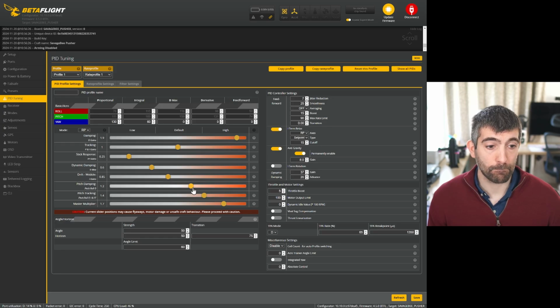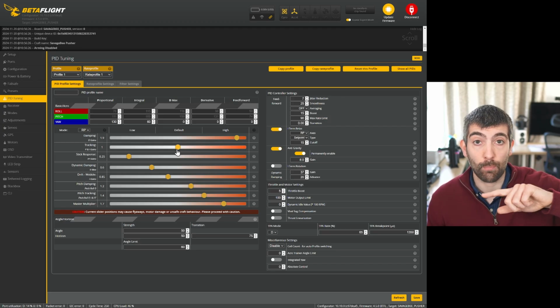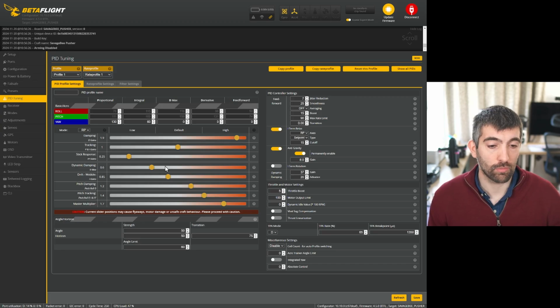And also the PD balance is going to be thrown off completely by the fact that we've got massive D-gain, but we've not increased our P gains at all. So that throws off the PD balance and causes the curves where the gyro doesn't reach the level of the set point, where the amplitude isn't the same. So we're going to need to make some adjustments here.